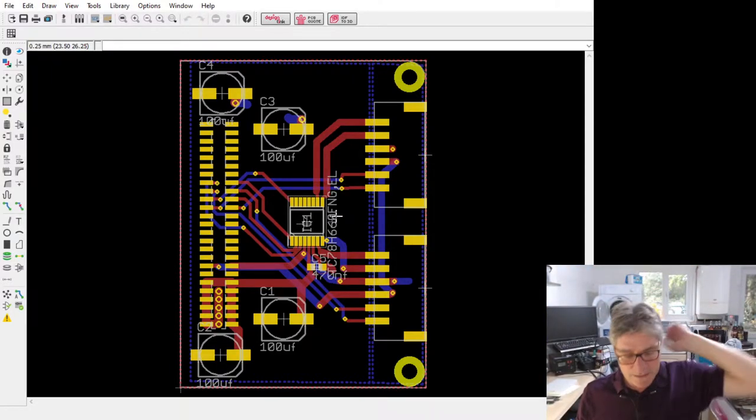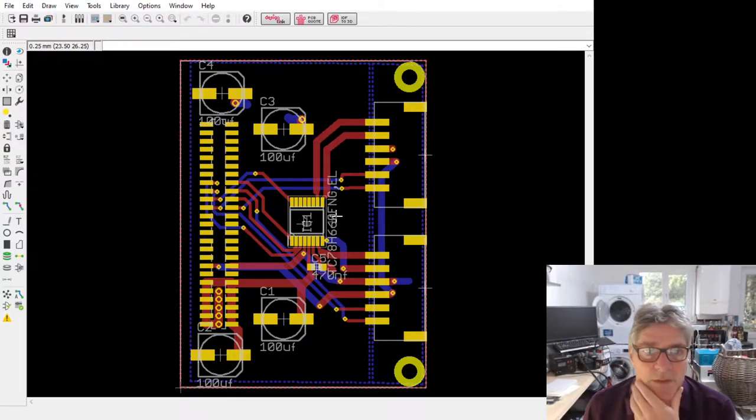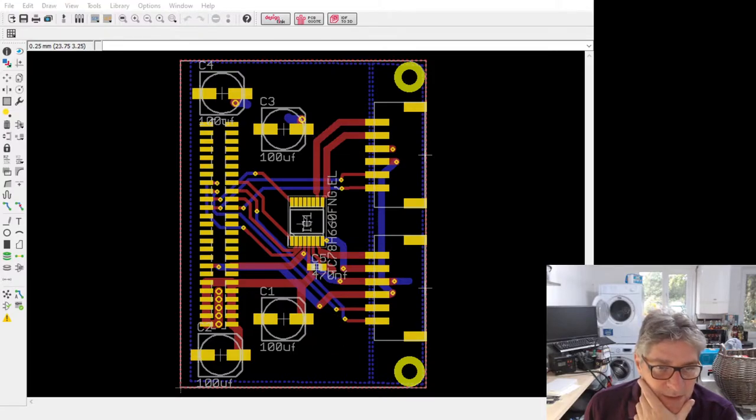So supporting the outputs from those, they have an A and B quadrature encoded output from a Hall effect device on a PCB. The way that those connect is through these kind of 6-pin connectors, and there's kind of a standard, but there is variation from the standard as well, I noticed, depending on where you buy these. On the tile to support these, I've used 6-pin JST PH 2 mm spaced connectors. You've got two motor driver PWM signals, a power signal, which is basically 3.3 volts and ground, and then you've got your AB signal.